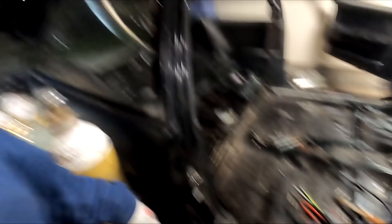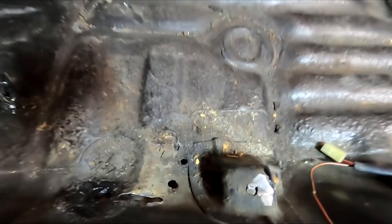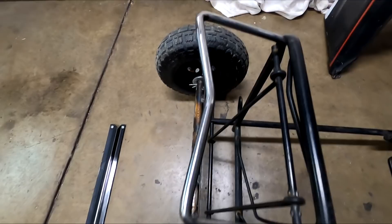Got the two square patched up. We want to get as much of the holes welded up as we can. Nikki just ran a flashlight underneath the car - there is a little pinhole right there where he grinded off the old bracket, and there's a little slit I need to touch up. He's going to grind that all to bare metal. I'm also going to patch up this random hole here, and there's one more on the other side as well. So while he's doing that, I'm going to help Fred with his little project - he's already got everything ground out and ready to weld.